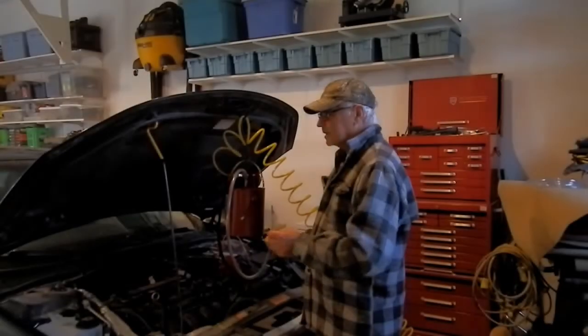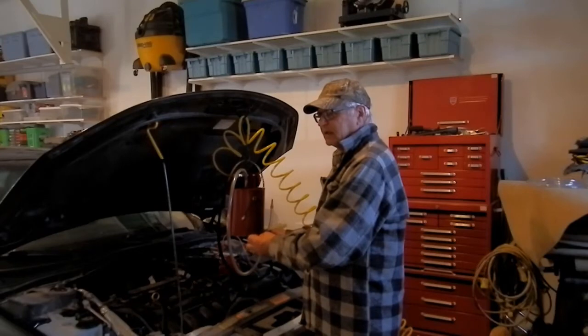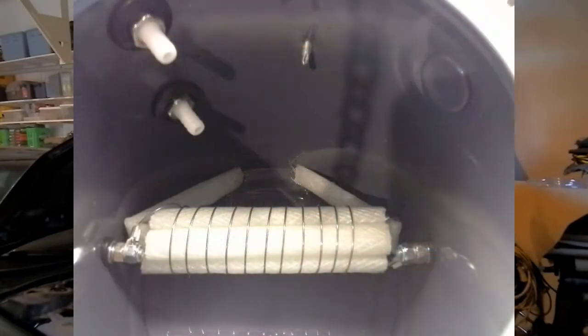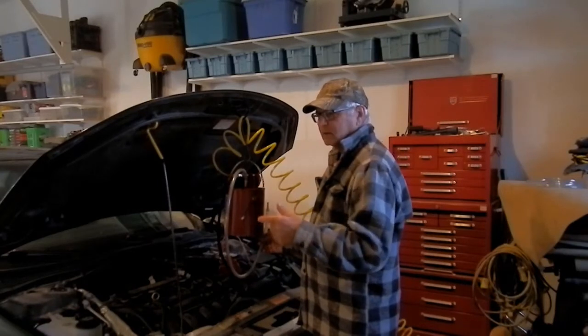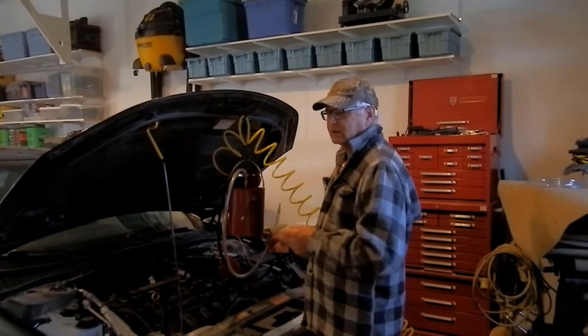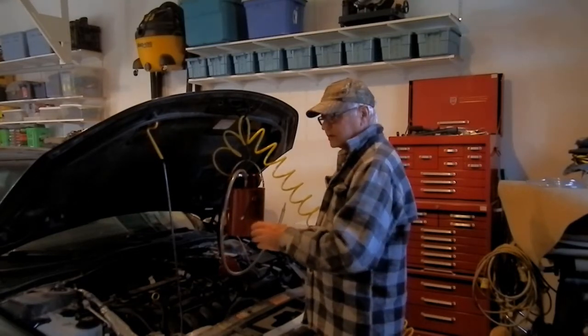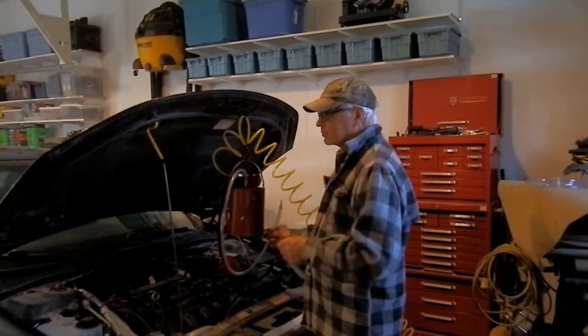I kind of liked it because it's more rigid — the whole assembly, the wicks and everything else inside, is suspended off that wire. Being five feet of length means more wraps, and to try to keep that under control I went to a larger diameter mandrel. I started with mandrels about inch and a quarter and it sprang open to about inch and five-eighths. There's just that much more wick inside than most — more contact. I think it's pretty good.